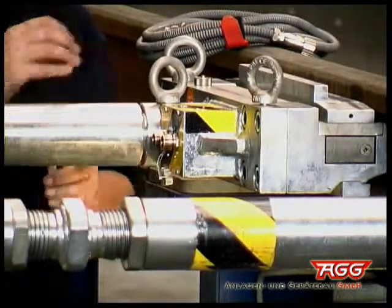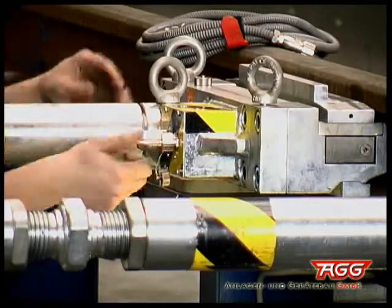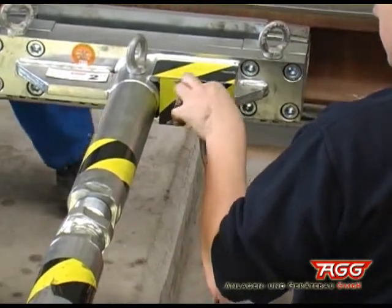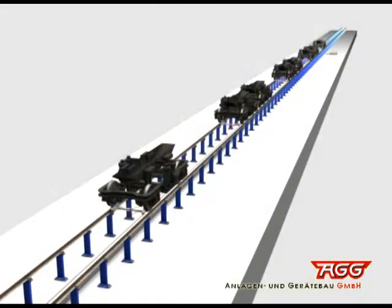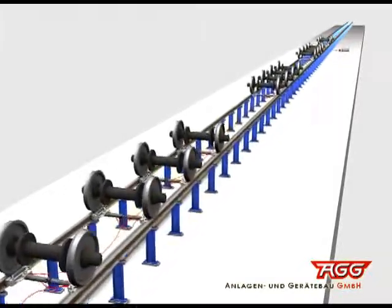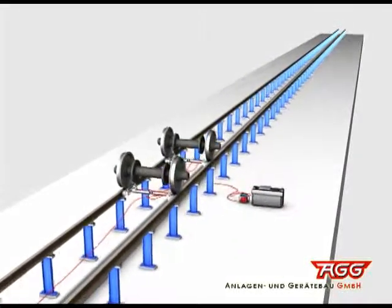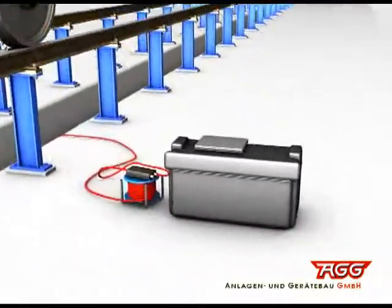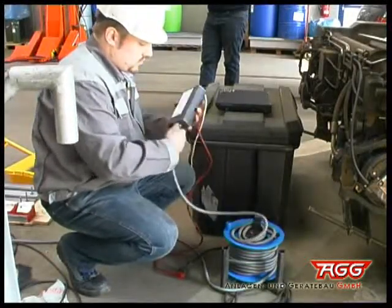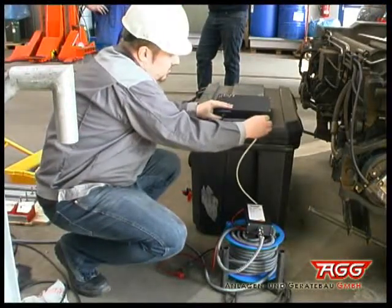The assembly procedure comes to an end with all measuring points being connected in series with data cables, beginning with an end adapter at the first measuring point. Since this is a digital measurement procedure, the system can be expanded as required. This animation shows the switching arrangement when a whole train is to be measured. The end piece of the digital cable is equipped with a power supply unit. The system is linked to the measuring computer by USB connection or Bluetooth interface.